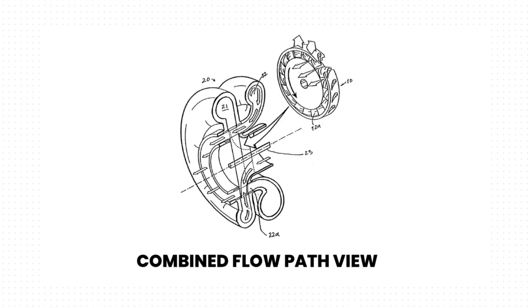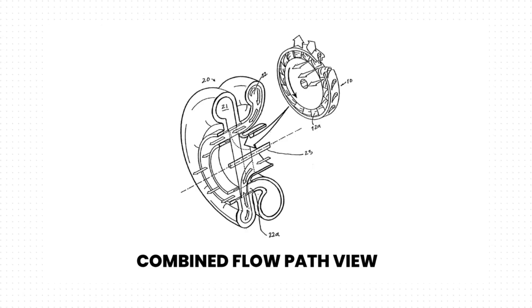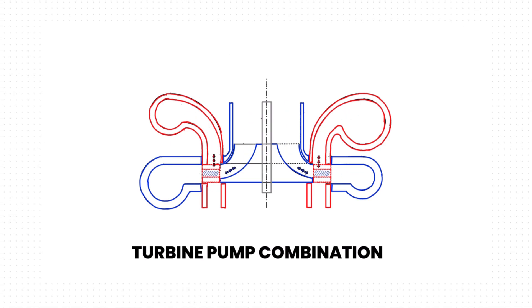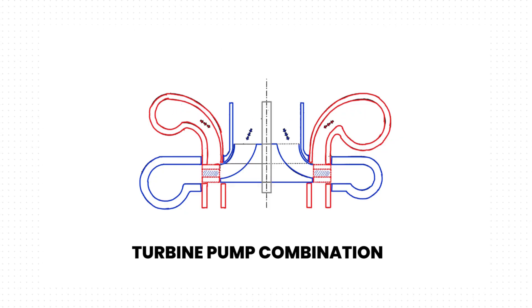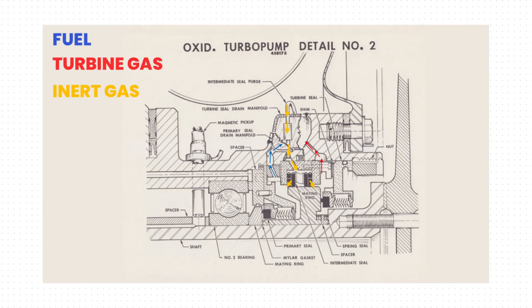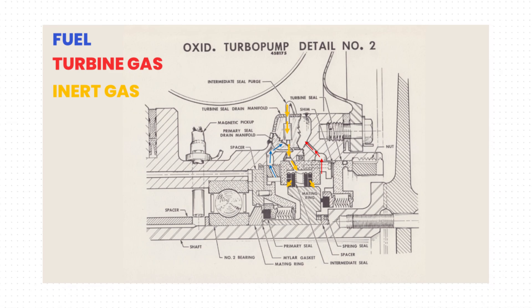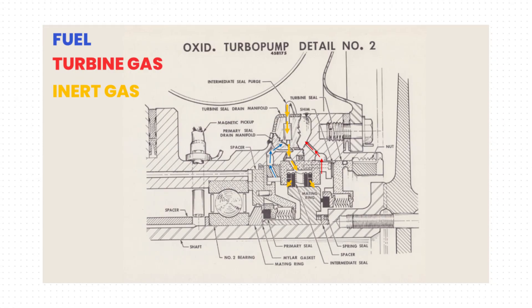This combined turbine-and-pump stage design avoids the problem of circulating cooling fluid against centrifugal forces, by letting the fluid pass through the turbine blades before introducing it into the volute. The volumetric flow through the pump and therefore through the turbine blades is also very high, making it well suited for effective cooling. In addition, the short shaft length means that rotor vibration dynamics are largely eliminated and the compact design leads to overall mass savings. However, at the intersection of turbine and pump, two different highly reactive working fluids come very close to each other, and if they were to come in contact, an explosion would occur. A comparable approach to conventional turbopump purge seal assemblies could be applied here — instead of sealing the shaft, one could seal the intersection area between pump and turbine.